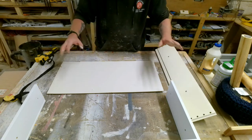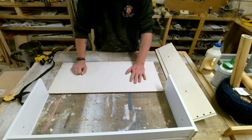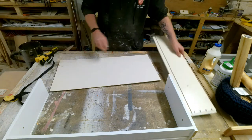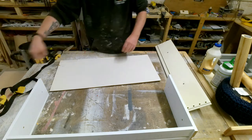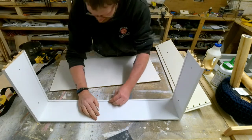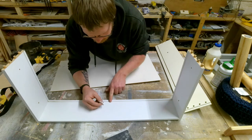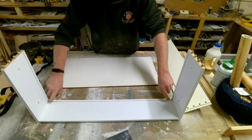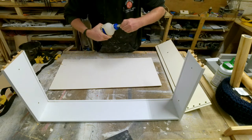I'm only going to repair one of these drawers because the other one's going to be exactly the same. We've got the drawer and the base — this base has got a little bit of a broken corner but once it's slotted in and the glue's there it'll hold well. To help hold this I'm going to use a band clamp — brilliant for square pieces, and you can take the corner brackets off to use them for any shape. I tried to use the bracket that's supposed to push the base into place but it's garbage, so I'm going to glue this in around the edge.